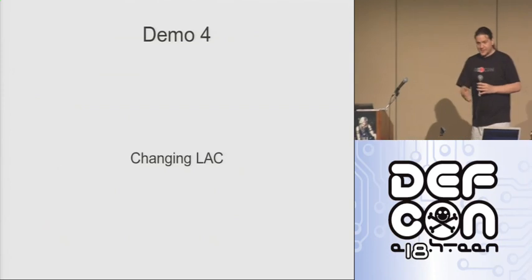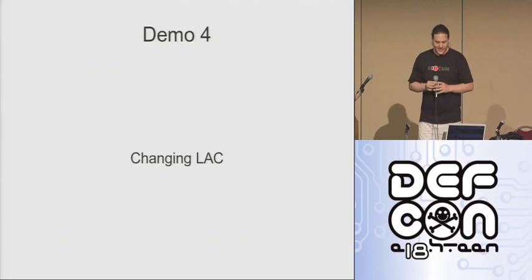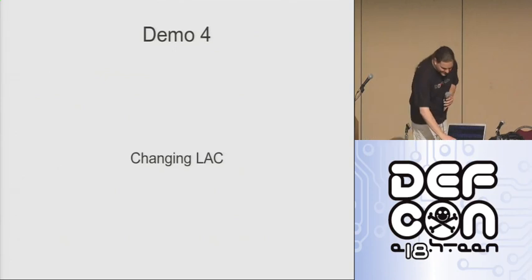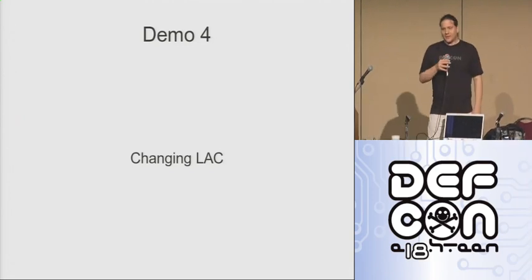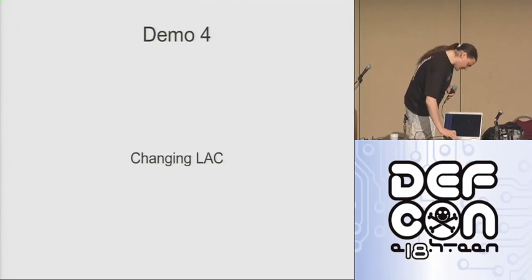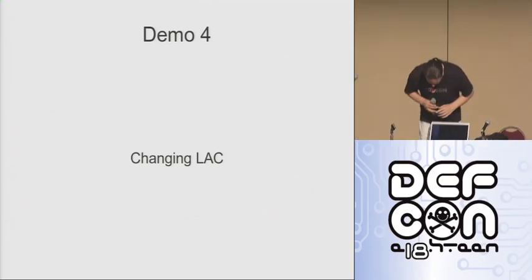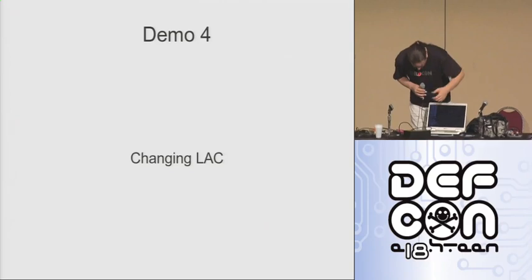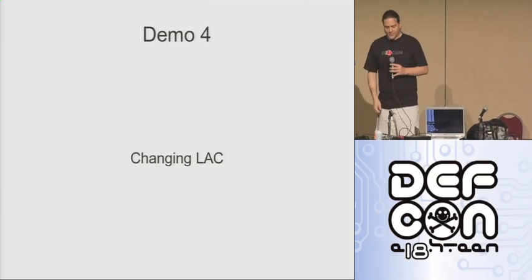First up, let's see how many handsets. Before we started spoofing AT&T, we had about 30 handsets connected. Now that I've got AT&T's network name, MNC and MCC, let's see how many handsets we have connected now. 24. Don't quite know how that went down. TIMSIs do time out. So another command that I can try is load. And this is telling me that there's 24 TIMSIs in use as well. Not too sure what's going on there, but we've certainly got a bunch of handsets connected.